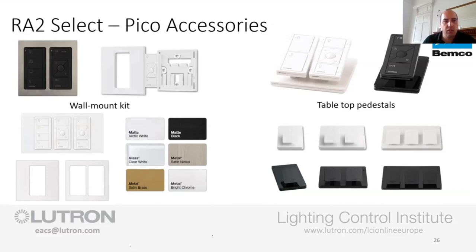If it's got side lugs, you can do it. Or if it's a metal box with top and bottom and left and right, then you can do any option that's there. The wee Pico just slots in, there's just two wee fingers that pop up. You slide it in there and then you pop the faceplate on to complete the switch or the Pico, and it's job done. The dual one is always going to be a side fix, but it fits straight to a double back box.